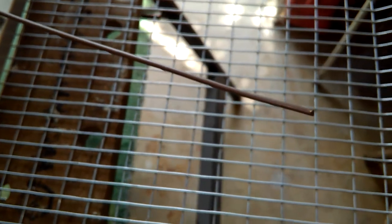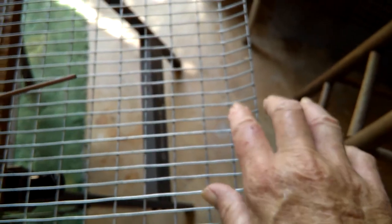The reflector material I chose is very tough — it's 16-gauge galvanized steel, mesh is one inch by half inch. It's tough stuff. Since it's outside in the breeze, you don't want it flopping around. Most antenna builders also curl the edge here — it adds a little bit of stiffness.